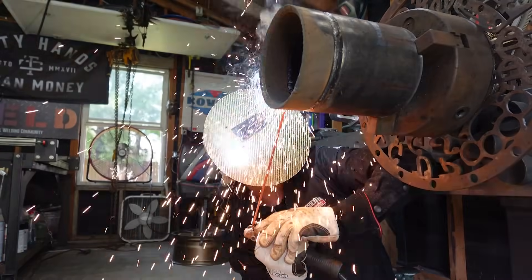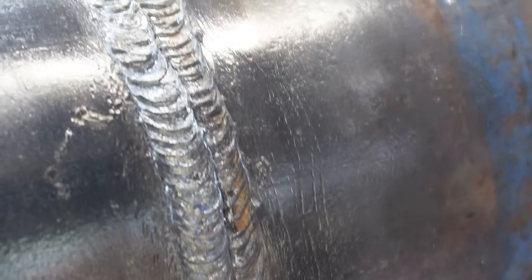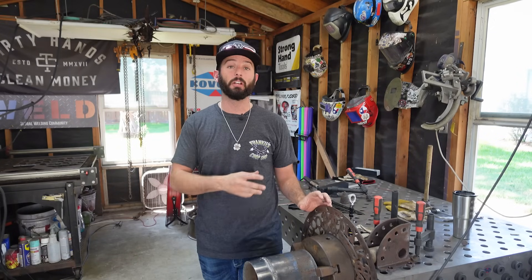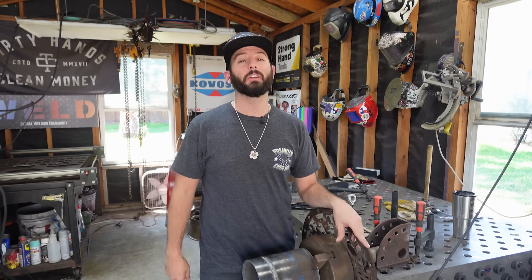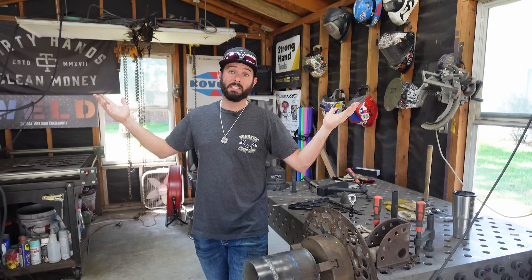For 6010, 8010, or that type of rod, we're going to be staying a lot more on the crisp side. But regardless of what you're doing, you can always start with nothing — don't even worry about Arc Force if you haven't figured out the other variables. There's a lot that goes into welding, and Arc Force is just one part of it. Master welding without it first, because you never know when you'll get a machine that doesn't have it. Welders before us didn't need it — it's just a nice feature to have occasionally.